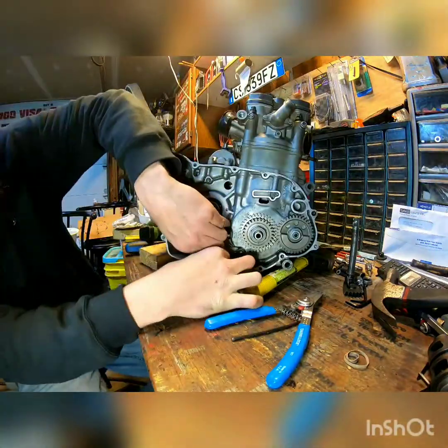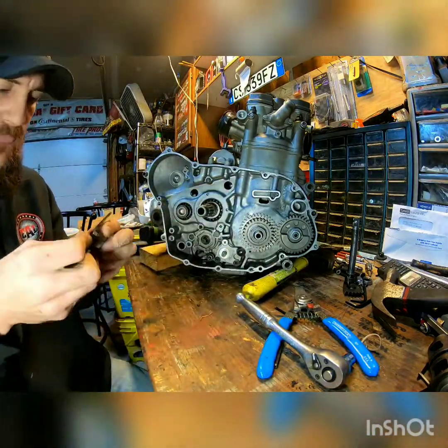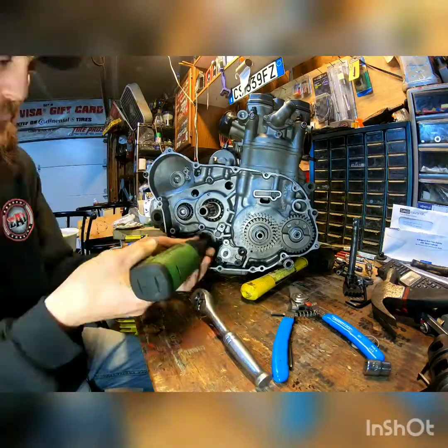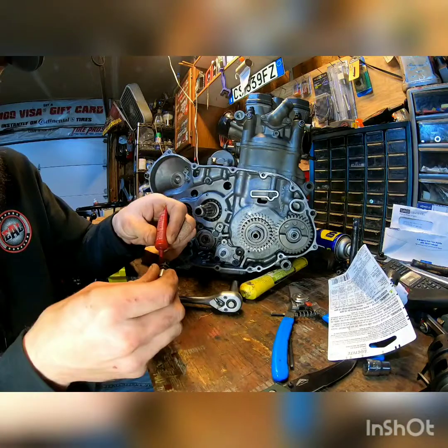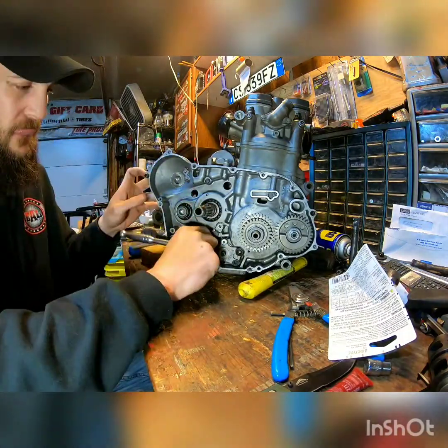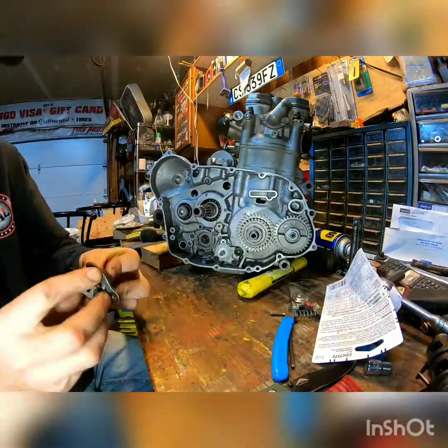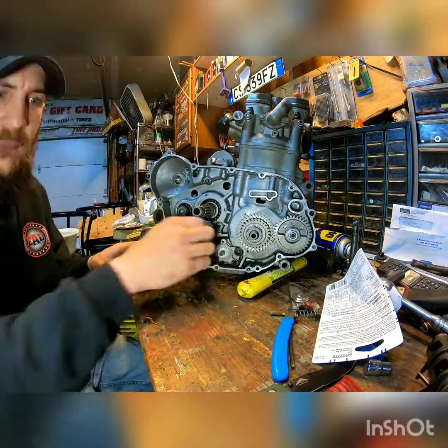If you watch closely here you'll see that tall gear and those little spring-loaded lifters I was just talking about. Don't forget to apply Loctite to these parts — it's very important, you can see I'm getting it here. The recommended torque for the bolt in the center of the pawl lifter is actually 22 foot-pounds. Gotta be careful — too tight and things will still bind up.